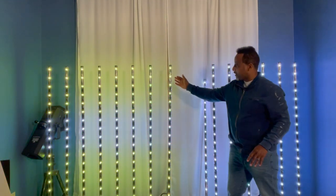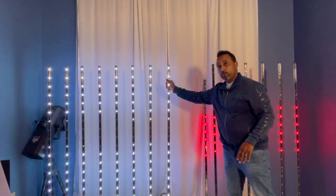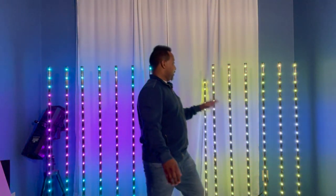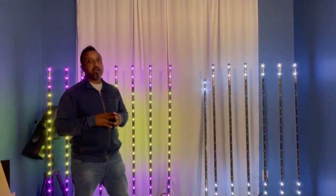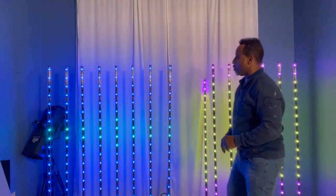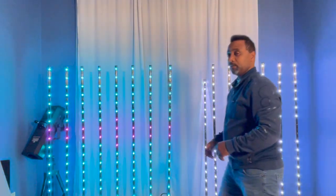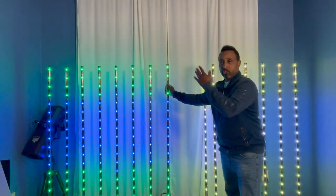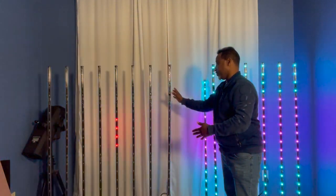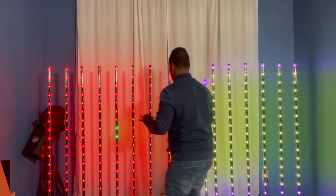This light has a new motherboard and a new LED assembly — and obviously these were from my newer purchase set. My conclusion is: if I wanted all of these lights here to sync like all of these lights here, I would literally have to replace all of these LED tube sticks. And that is not cost effective. However, that is the solution to the problem — it's already proven that by changing out the LED tube ordered from chauvetparts.com, this light no longer syncs the old way but now syncs the new way.